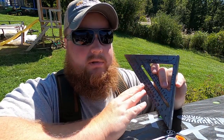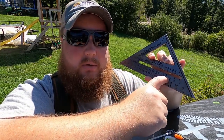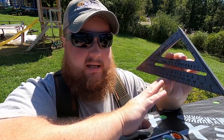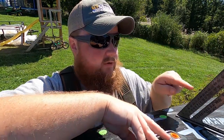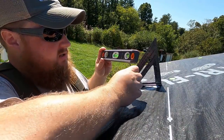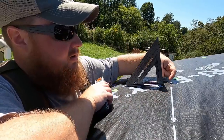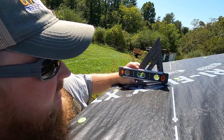On the speed square, you'll be paying attention to your pivot point — that's the top corner where both edges meet — and then the 'common' label with numbers, which are common rafter pitches. Take your speed square, lay it flat on top of the roof with your pivot pointing up. Then take your torpedo level and rest it at the pivot — be sure it's not hitting the roof and not too far back. Hold it in place and sight down the torpedo level.